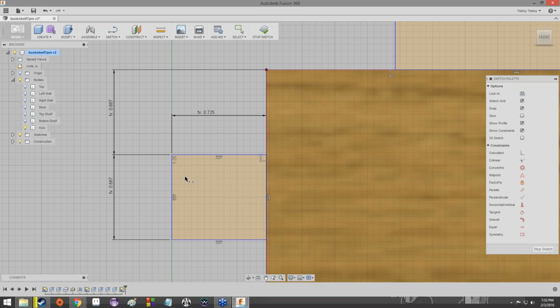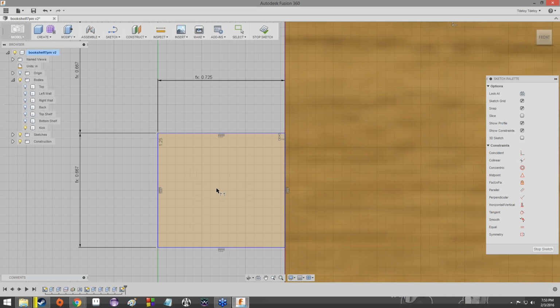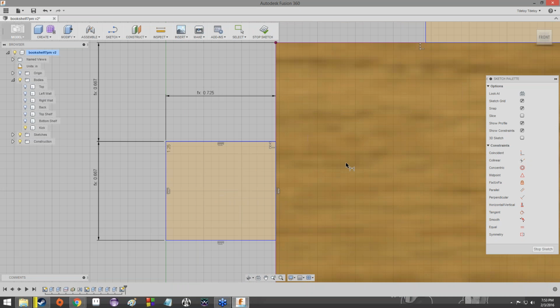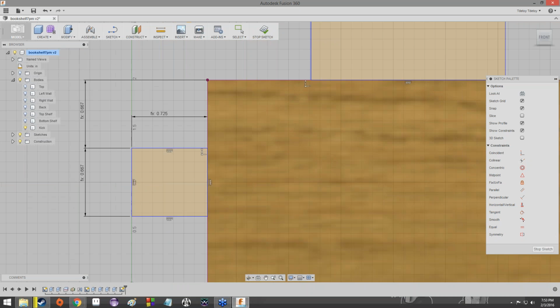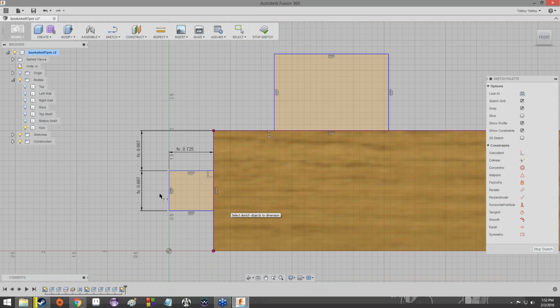All right. So with that, we've actually fully dimensioned this left-hand tab. We've got it sticking out a length of ply. It has a width of kick divided by 3, and it is kick divided by 3 inches away from either side of the kick plate. I mean, you know, math. If this is a third and this is a third, there's only a third left. So, yeah, it is 1/3 of kick, which I believe was 2 inches. Yeah, it was 2 inches from the top and bottom.